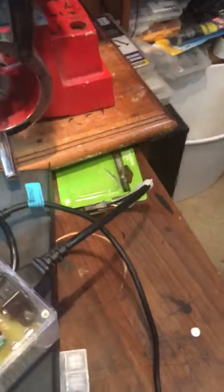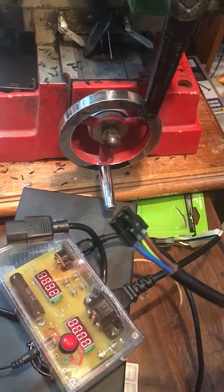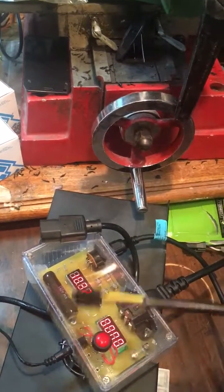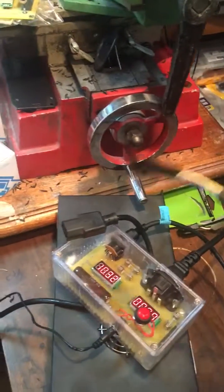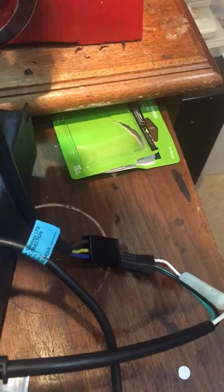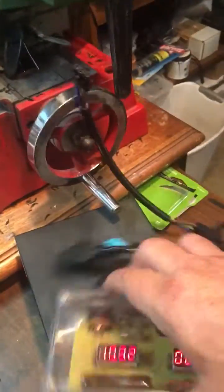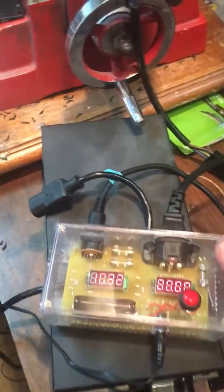As far as the brand new power supplies are concerned, you just grab this little adapter that PianoDisc now sends with the brand new power supply — you know how they send a 10-volt supply and a 40-volt supply. The 10-volt is just a little adapter, but you can test that thing as well. You just use this and plug it into the old switcher adapter. You just snap that together like that, snap that together right there. Notice how it's snapped together, and then you plug this end into the latest power supply that PianoDisc sends. Very handy little tool to test all three power supplies.